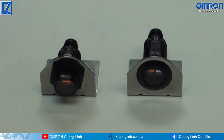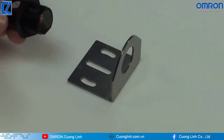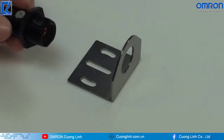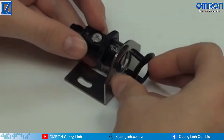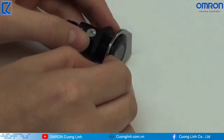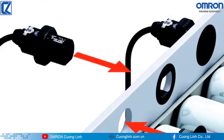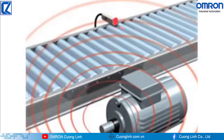These sensors can be mounted using a mounting bracket or through a flush mounting bracket, which increases mounting flexibility. It's very simple to use the flush mounting bracket, but it should be noted that you should have the connecting nut on the sensor first. Flush mounting allows use of the E3FA and E3FC series in high traffic areas where there is concern of the sensor nose being bumped, like when mounted through a standard bracket.